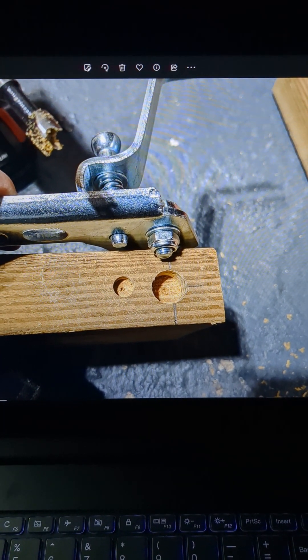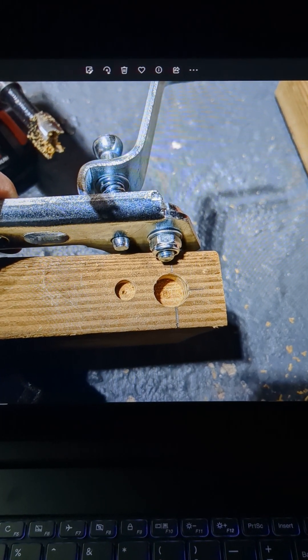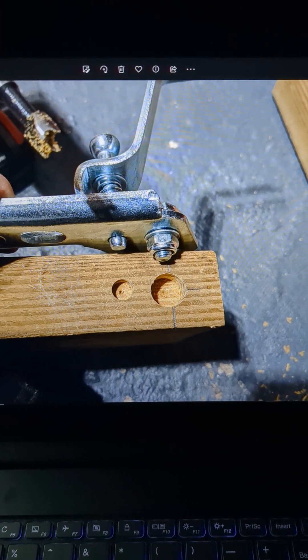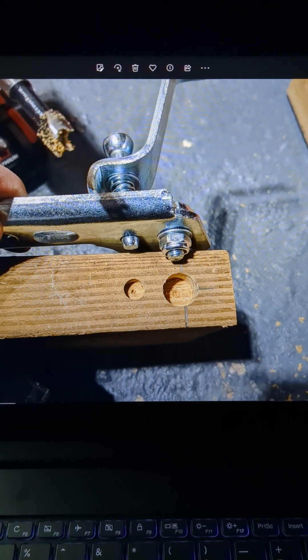The training wheels had these two protruding pieces coming out of them, and I needed to find a way to make the sidewall flush with the wood. So I used two different size Forstner bits to make a home for these pieces so they sit inside the wood, allowing that angle to sit flush. This is what it looks like flush inside against the wood.